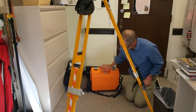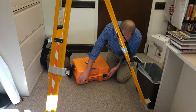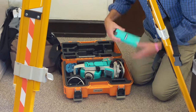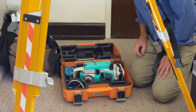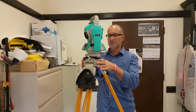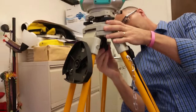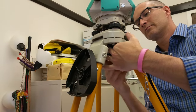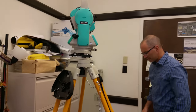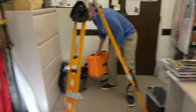If you see 'Nikon' on the box, it's facing the correct way. There's also an arrow that says 'open' pointing up, and there are safeties on the box so you can't accidentally kick it open — flip those up and open it. When you take the total station out, hold it with two hands. Put it up on the plate, line up the triangles, and screw it on — snug but not super tight, as overtightening is bad over time. Close the box lid right away so no dust or rain gets in — dust is the worst enemy with these instruments.